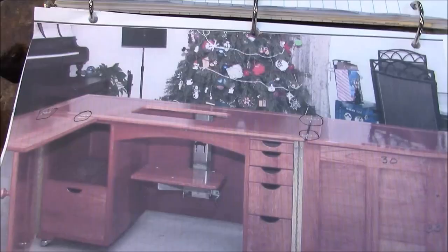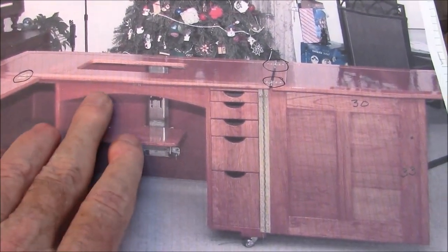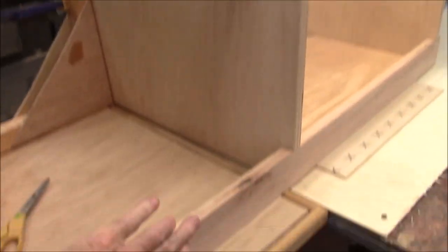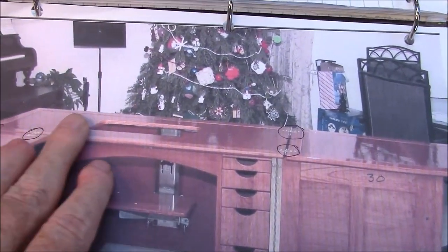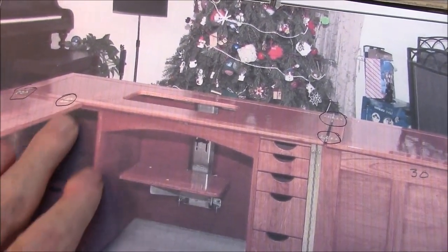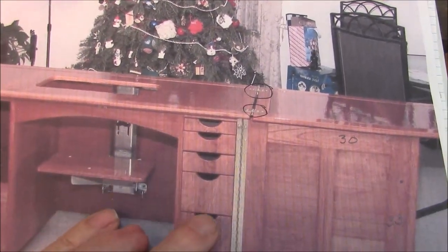The second thing we're doing is putting this radius piece of oak between the two boxes — that'll both stabilize them and provide support for the top. The third thing: the back will be covered with a sheet of half-inch maple plywood running the entire length to pull it together into one unit. Finally, the top will be connected to both boxes along the edges, bringing the whole unit together as one piece.